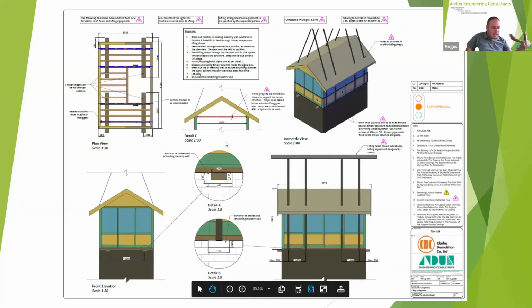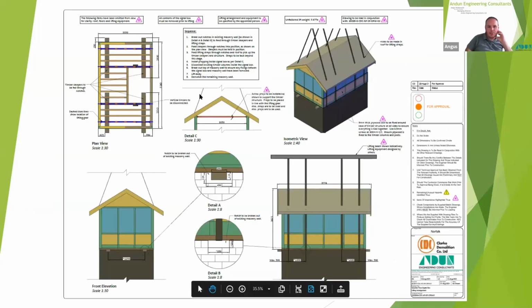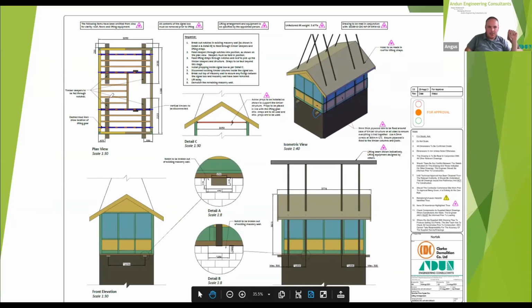So, as ever, contractors want cost-effective, simple solutions to things like this. So we came up with quite a simple scheme whereby we needle into the masonry here and here, both ends, and that allowed sleepers to be put in here, and the same the other end, there and there. And then we could sling around and underneath, so you cut pockets in the masonry there, and there.